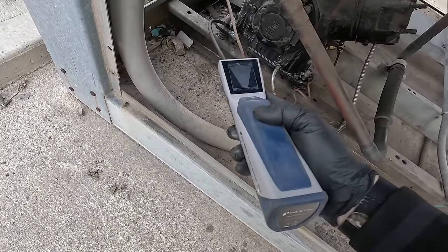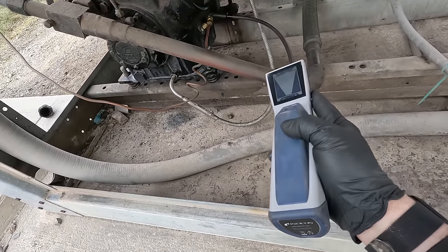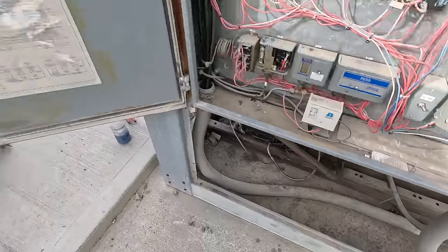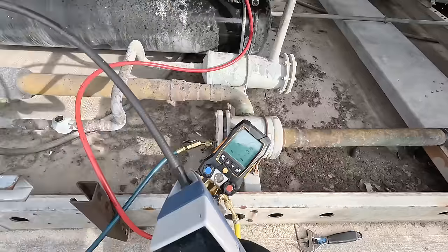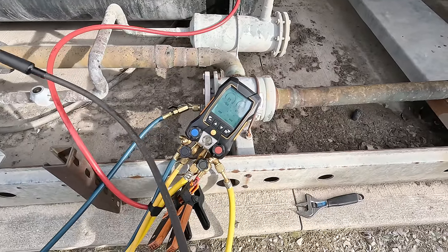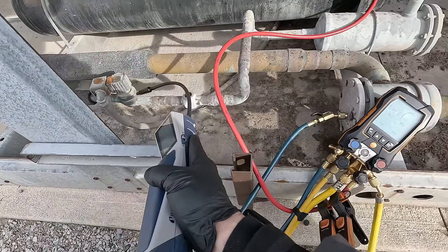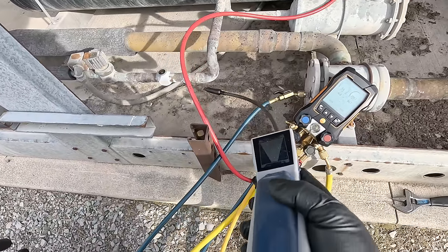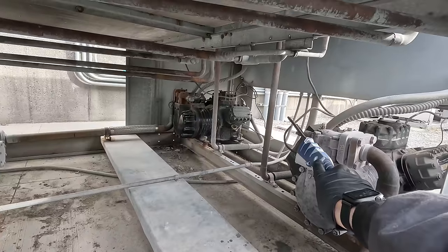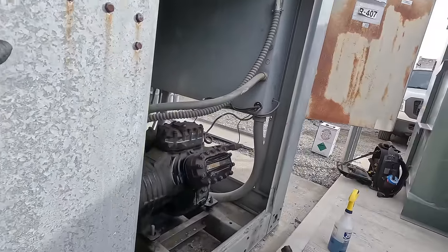Let's see how we're doing down here. Last time we were getting some pretty good size hits down here on the oil fill. She's shut down - satisfied, and may have washed out the oil too. It's pumped down to 10 PSI. Now we can at least scan the high side - it's got 212 pounds of head on it. But the low side is going to have nothing there to set anything off. Getting a little bit there on the suction, but nothing probably humongous.